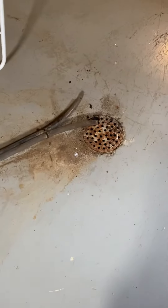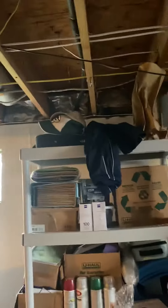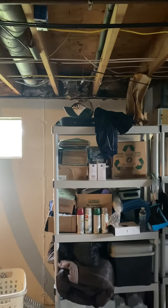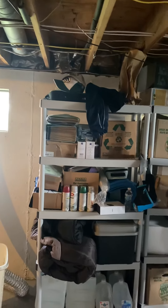It drains right in front of the unit — just bring some vinyl out and cut that on site. The only other thing down here is the line sets. You can see there are two different sizes that have been brazed together, running from where I'm standing to that back wall, about 10 feet. So we'll need no more than 20 feet at most — we'll just cut it short.